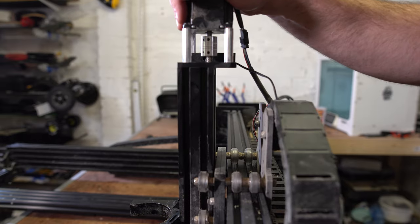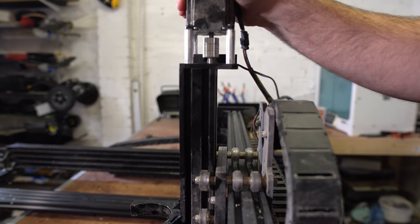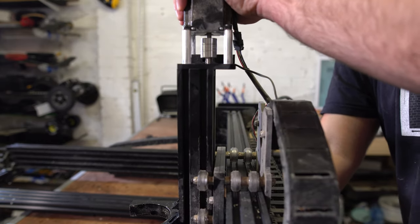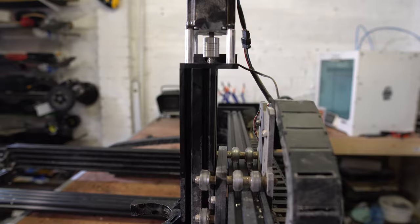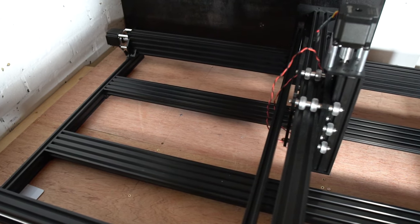The other thing I don't like about the machine is how much flex it has. It is fairly rigid if you're cutting wood — you'd never have any problems and probably never notice any issues at all — but cutting metals you start to see issues with the rigidity, particularly the flex around the X-axis. If you grab the Z and start moving it, you can feel the whole thing twisting, and when you're cutting harder materials that is a problem.